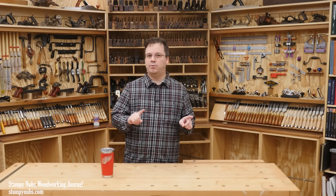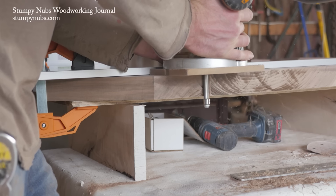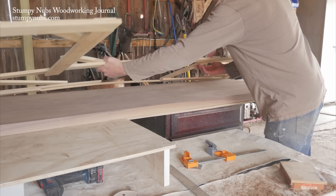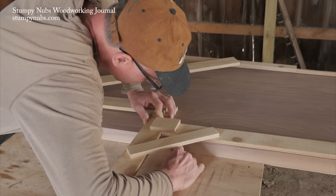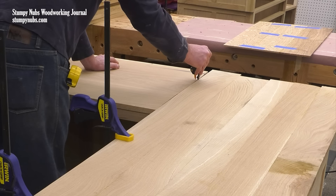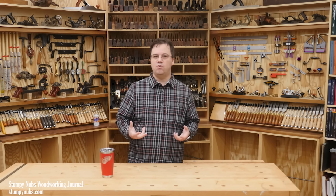If you aren't able to get a perfect seam with your circular saw, consider using a router and a straight edge to just skim the edge with a straight bit. This will clean up any blade marks and ensure a tight fitting seam. One thing to keep in mind is you shouldn't assume that your cut has to be a perfect 90 degrees or 45 degrees for a miter. In the countertop project, we made a template for the cabinets at the actual job site and then used it to mark the inner and outer corners of the joint so we could get the proper angle. On the desktop, we placed the two halves on the frame and scribed the end of the panel that was to be trimmed right to the edge of the mating panel. This prevents errors in the frame, cabinet installation, or walls around cabinets from compounding into the tops as well.